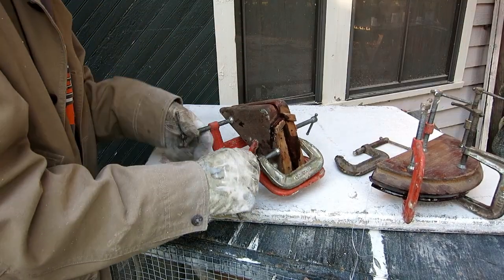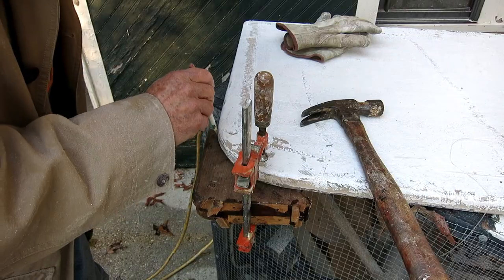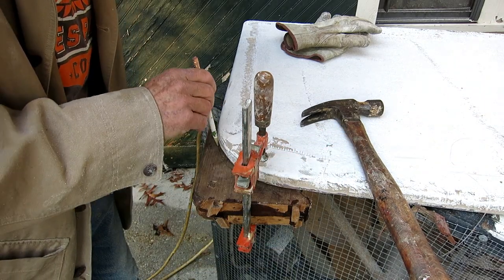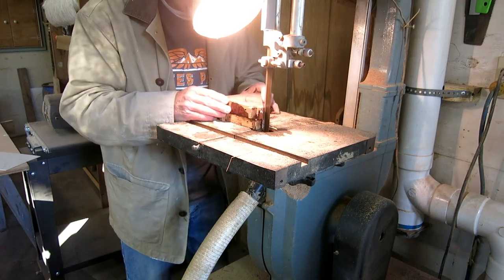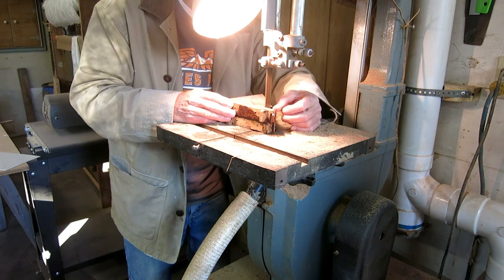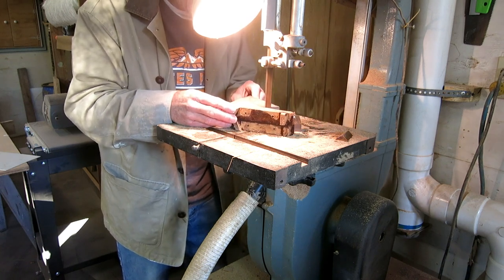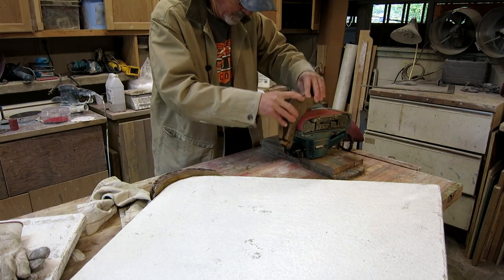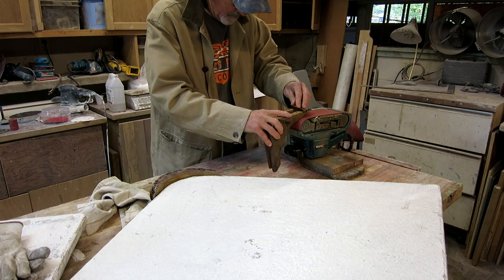Repeating some things from last week's video: I glued up some blocks to make the corners. I didn't have anything big enough to cut these rounded corners out of that was thick enough. So I glued these up, put them underneath the actual swim step and traced the line, then cut the curves on the band saw and refined them with the belt sander. I lopped the outside corner off these little blocks so my clamp would have a 90-degree surface to pull against. There'll be some short grain here, so I didn't want to risk the piece cracking when clamped tight.